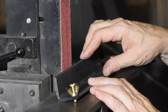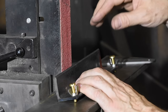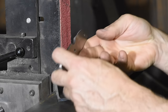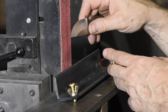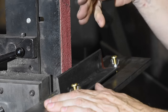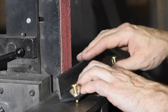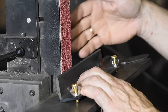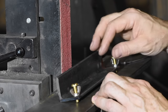Let me talk first about what the purpose of a jig is. The most basic justification for a jig is that it helps you set a nice, clean, predictable angle and grind fairly clean and predictable bevels. Freehand grinding is one of the hardest skills to acquire in knife making, and a jig is a good way of getting your sea legs as you learn how to use a belt grinder. Beyond that, jigs can be very useful for production — it allows you to speed things up. It absorbs some of the heat generated during grinding, so you can make more blades faster.